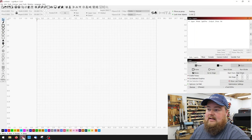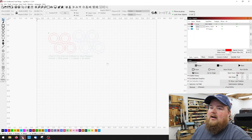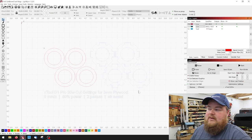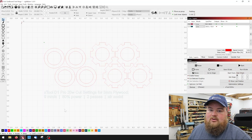Let's jump into Lightburn and open the first file of this project — the one used to cut out feet for your grid board. I'll go ahead and open it. This one is called X-Tool Gridboard Feet Rings. When you open it, you're going to have eight different feet rings of two different designs. I've put text down here sharing what my particular X-Tool D1 20-watt laser will cut Baltic Birch plywood at: 9mm per second, 80% power, and two passes with Air Assist on and on a honeycomb bed. If you don't have Air Assist, or a honeycomb bed, or if you have a 10-watt, you'll need to tweak these settings. I figured I'd give you my cut settings as a place to start.